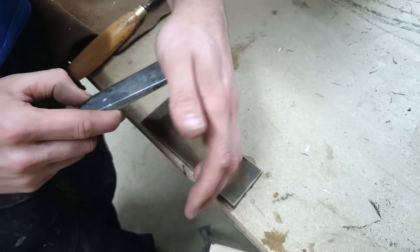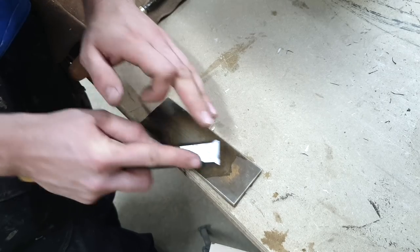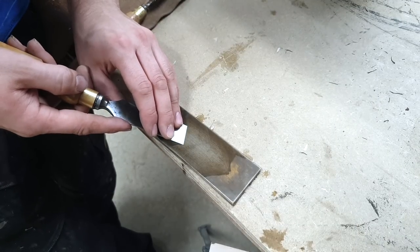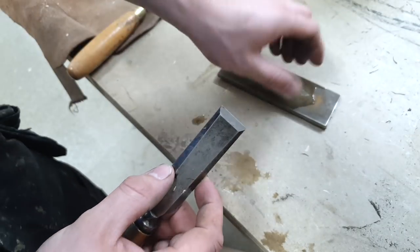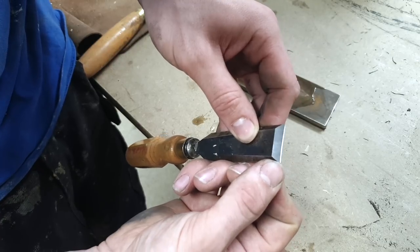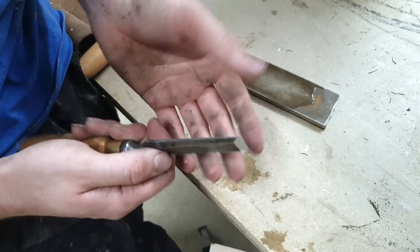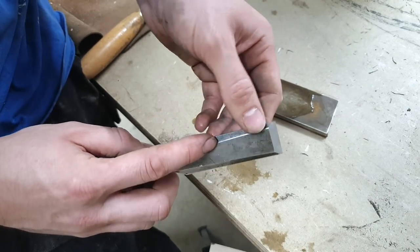Run your hand or a leather strop over the edge down towards the face, then put the chisel down in a forward motion so any burrs get cut off forwards, creating a clean edge. Polish the back edge again, find your bevel, lift it up very slightly, and go forward a couple of times from both angles. You don't need a massive two or three millimetre secondary bevel — as long as the edge is at the cutting angle and finely polished, that's all you need. Do as little as possible so it's easier to get a new edge each time.